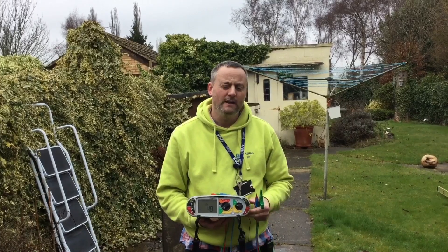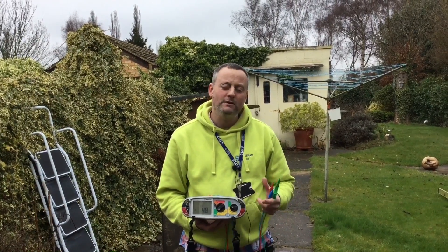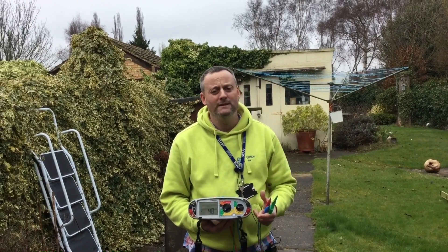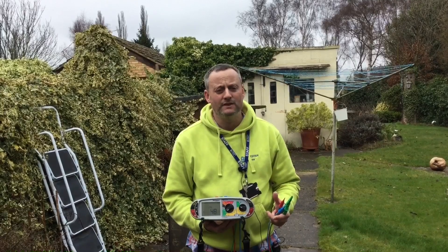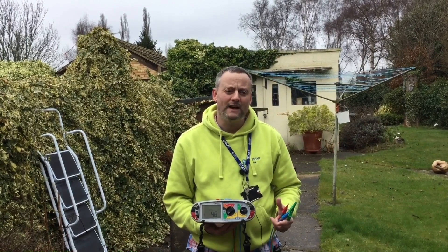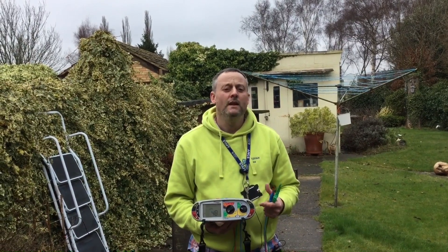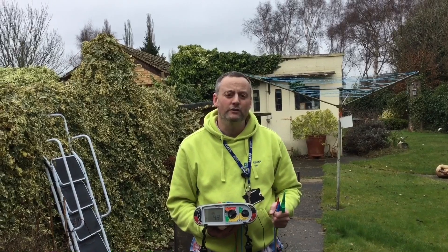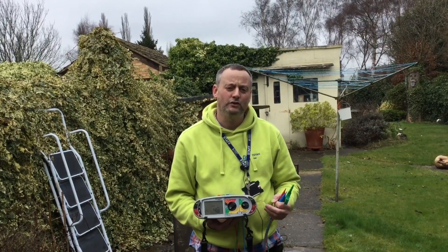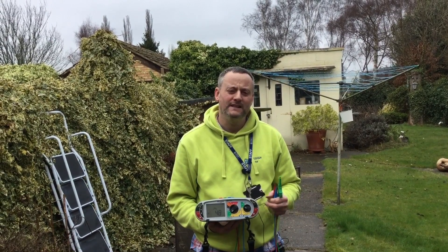You just have to get the RCD test on it, but I still want to know what the impedance is to earth. As that's going to be too high, we must prove between line and neutral and confirm that would disconnect the circuit and the impedance is low enough according to BS 7671. So let's recap: we're on a TT supply, earth faults will be cleared by the RCD, but I'm going to make Jack do an earth fault loop impedance test to see how high it is, then do an impedance test between line and neutral and confirm that reading is low enough to disconnect in a short circuit condition.